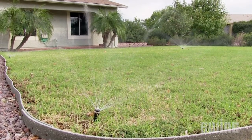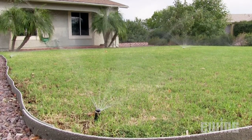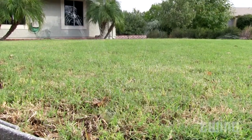For example, if it takes your irrigation system six hours to complete a daily irrigation cycle, then you should set the cycle window time to seven hours.